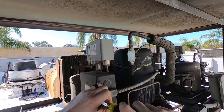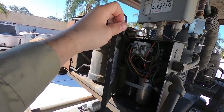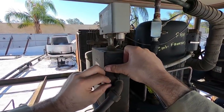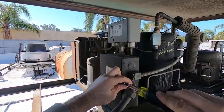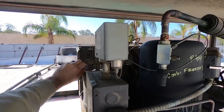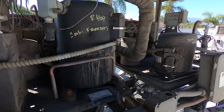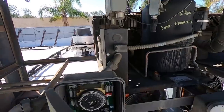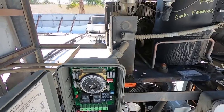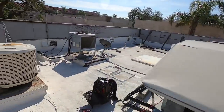Giving it time for everything to start up. We're going to inspect the electrical a little bit more before we turn it on. This is the electrical panel for the unit — don't see nothing bad in there, nothing shady. I've already tested it to ground, there's no direct short. Spin the condenser fan motor to make sure it's not locked up — condenser fan motor is not locked up. Don't see any problems, so we're going to go ahead and fire this guy up. Checked the defrost clock — it's fine, don't see anything wrong with it.